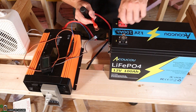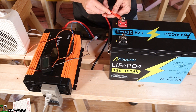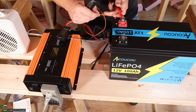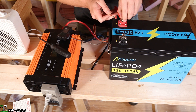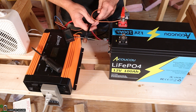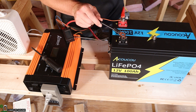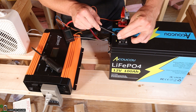To get this test underway I need to hook up my equipment. I'm going to take the positive cable of the inverter and place it on the positive terminal of the battery. My little meter needs to have power from the battery so I'm going to connect this. I don't want anything to be between the terminals and the battery cable, so this needs to go up on top of that cable. It's a good idea to use a resistor here on the battery to charge up the capacitors in the inverter. I forgot mine up at the house, so it's probably going to have a little bit of a pop — something you don't really want. You can use switches or breakers to prevent that.